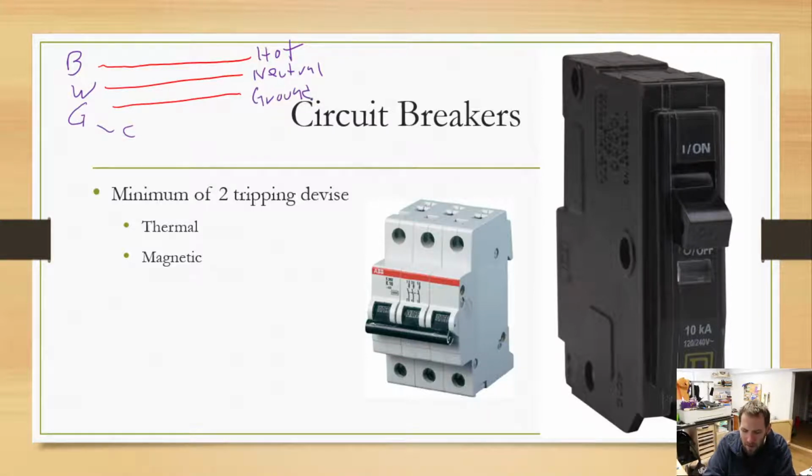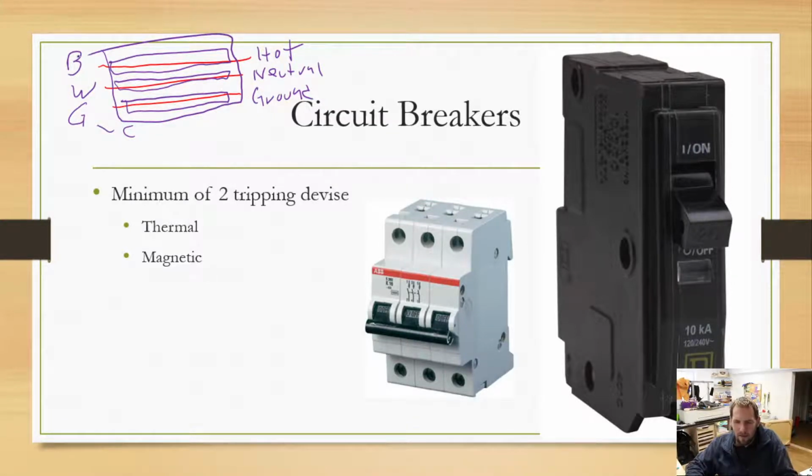Normally those three wires each have their own individual protective coating. They're all insulated, and then those normally are all in another white coating. So there's actually three different coatings going on, none of which you can see here. But you can see the black wire and the white wire. This one does have a red wire. This is a little bit of an abnormal install because this is meant for a heater instead of a 120 circuit. But anyway, we do have three different color wires.